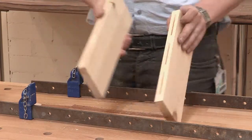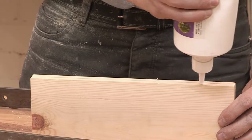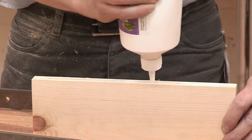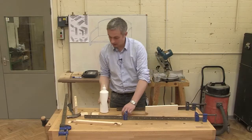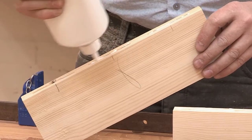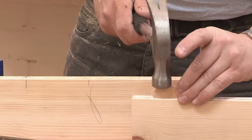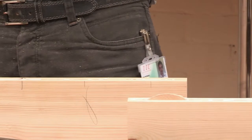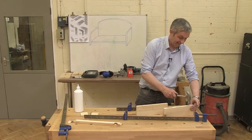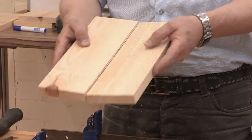All our slots are cut and we're ready to put everything together with PVA glue — just a small smear on the meeting faces, not too much. We don't want a lot of squeeze out. Then we drop a little bit of glue into the slots and into the mating piece where the biscuits will go. We don't need to overdo the glue. Then just tap the biscuits — you can see why they're called biscuits, they look almost like a biscuit you'd have with your coffee — tap them into place. Now put the two bits of wood together, remembering we've got our face side to match and our little index points.